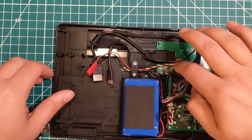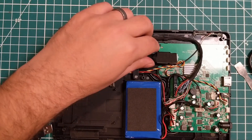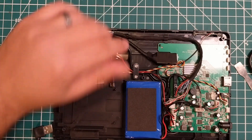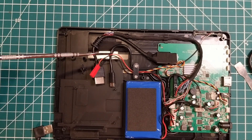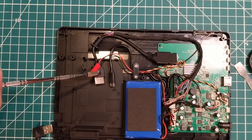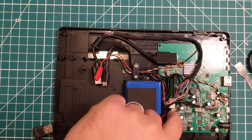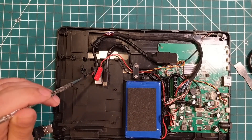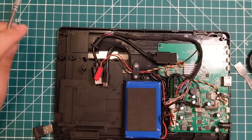So you've got the battery pack, fan connector, and then this is your USB. Looking at this, you can see there is a full-size HDMI port right here. What that tells me is that if you had a short micro HDMI adapter, you could probably get that to work. This is your USB for power, coming right in here to what I think is a JST connector — in other words, you actually could adapt this out for the fittings you need for a Raspberry Pi 4.